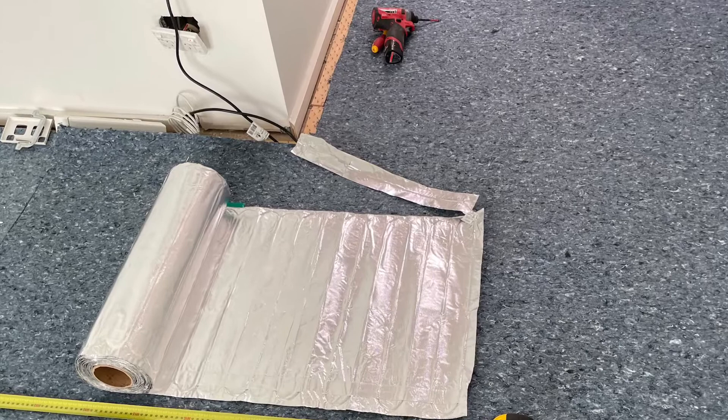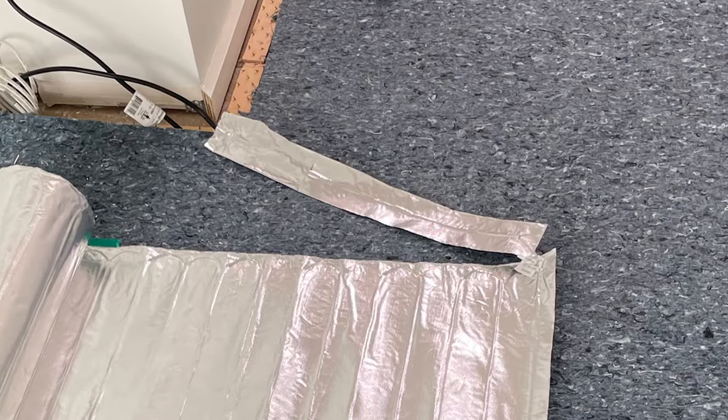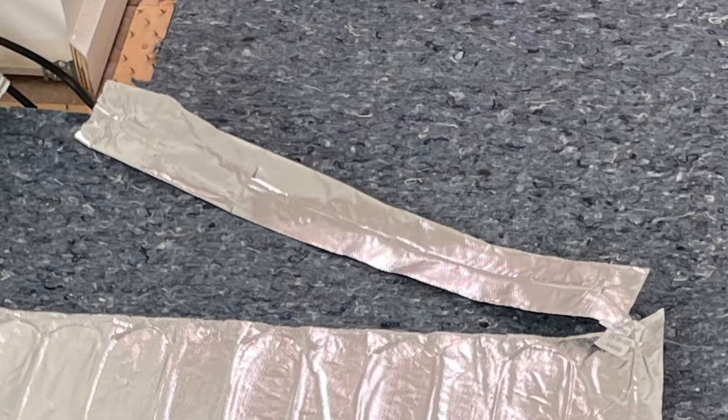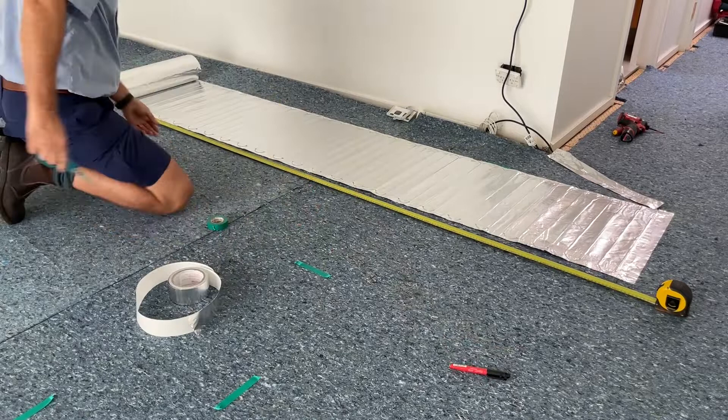To start your first run, you might be a distance away from your conduits. To enable you to do this, you'll need to cut along the first run of the element. In this case we've got 50 centimeters, which is the first run. In your own situation you might need more — you can cut the second and even a third run, which will give you a meter or a meter and a half.